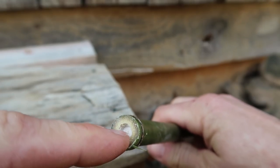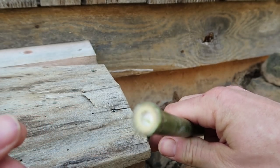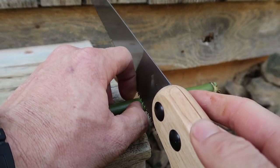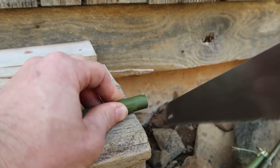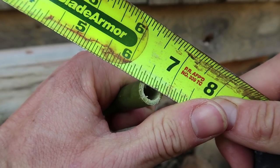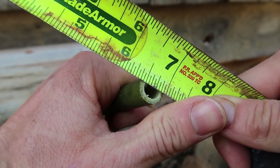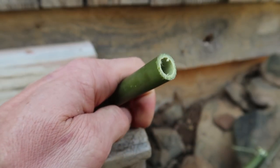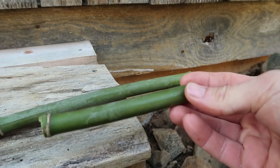You can see that that little divider is actually solid and will work as a cap. We're gonna measure five inches and put a little mark there. Now we have this little pipe with a cap on one end and an open end. If we measure the interior diameter, it's actually three-eighths of an inch, a little larger than the ideal five-sixteenths of an inch, so there will be some variety. Now we're just gonna cut as many of these as we can, using this piece as a guide.